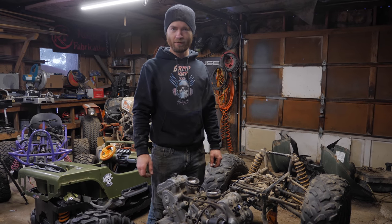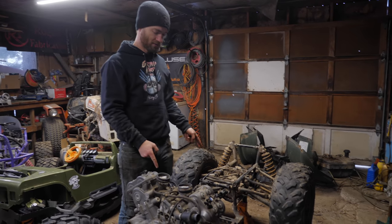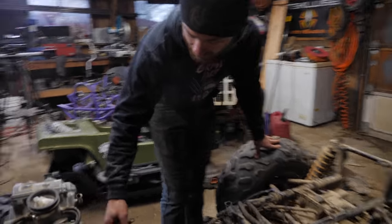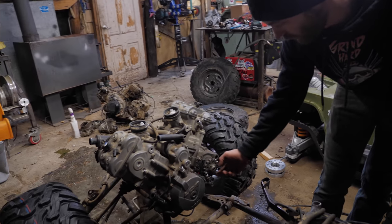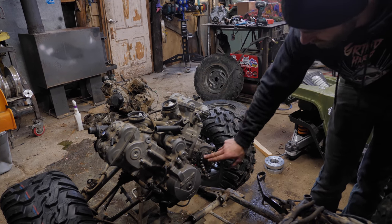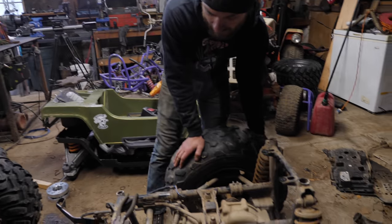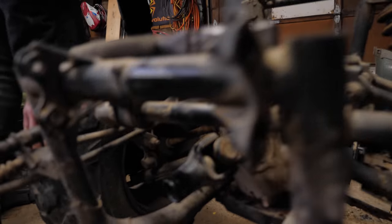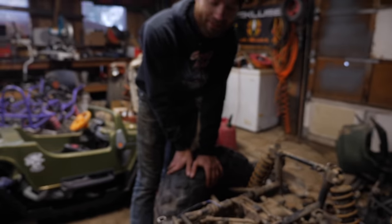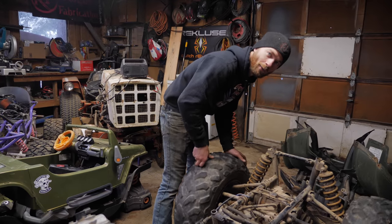We've run into a bit of a problem, very much an unforeseen problem, which is the drive is the wrong direction. This engine, the sprocket drives, in its current position, counterclockwise. You can imagine if that's straight chain drive to the rear wheel, that would be going forward. So that's the direction it spins. This rear diff, if you spin the tires forward, it goes the opposite direction. And so does the front. So if we were to drive it clockwise, we'd be going real fast backward.